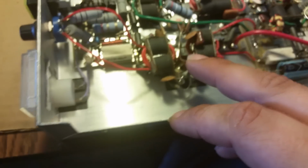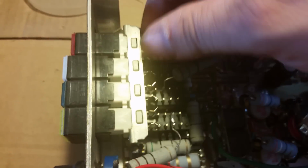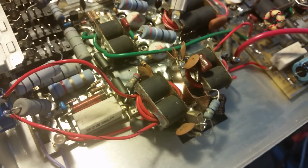Let's see. You can tell somebody had replaced this driver transistor. You can just tell by the way it was put back. It ain't the prettiest thing in the world. But I had to replace the bulb on the front power. Didn't have no lights there. Went ahead and did my solder job to the tabs as I usually do with every Texas Star. And I had to put brand new 330s on all the C-B collector base.